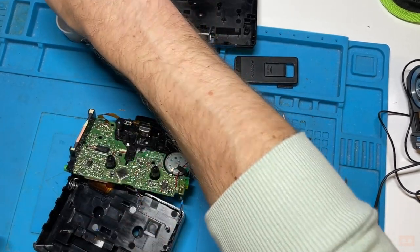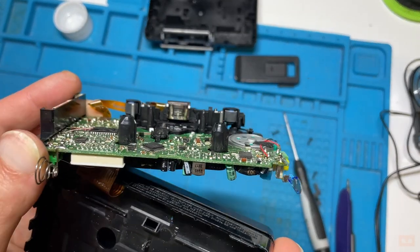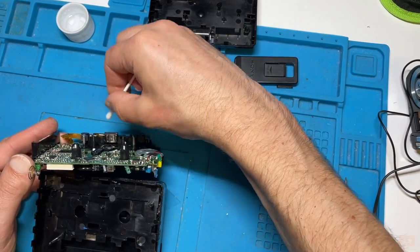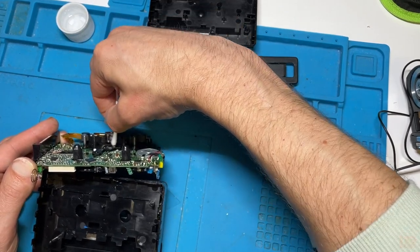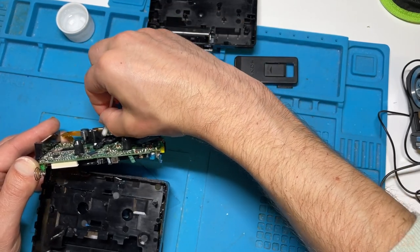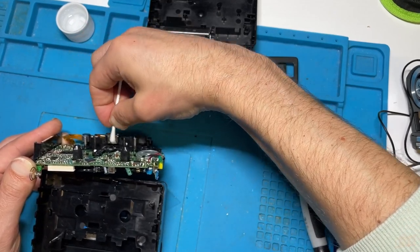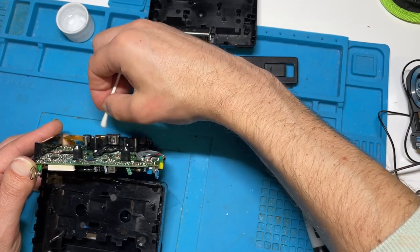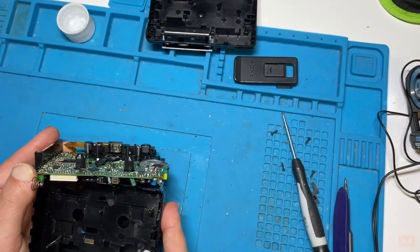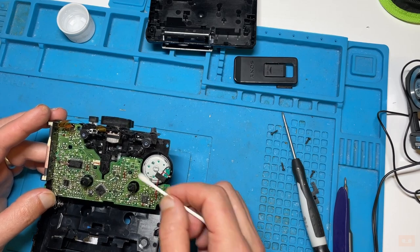And then once that's done, cleaning the head of the recorder. Now you can see in here there's a number of different settings because it's going in two different directions. And obviously the head is what reads the tape, so there was already stuff on there. You want that nice and clean. I also don't want to introduce any fluff, so there we go, a lovely clean head. Sometimes they can be a bit dirtier than that, and they require a bit more scrubbing.